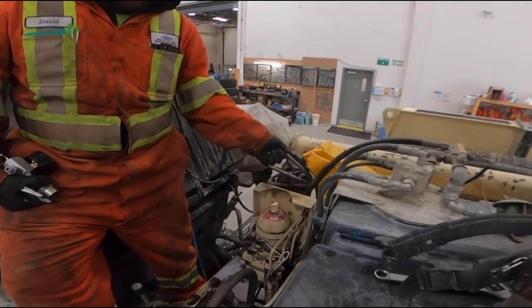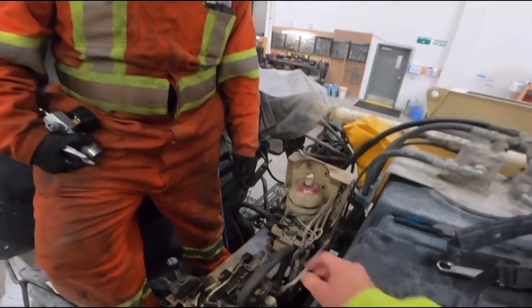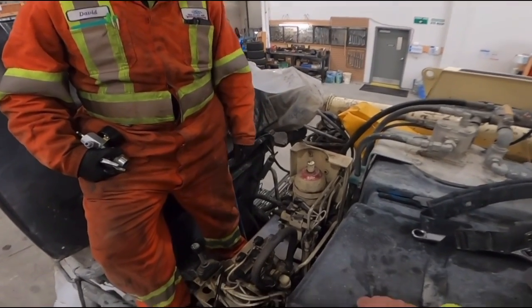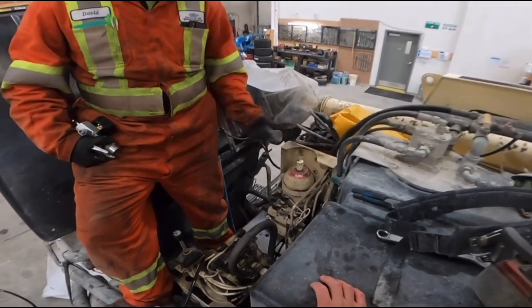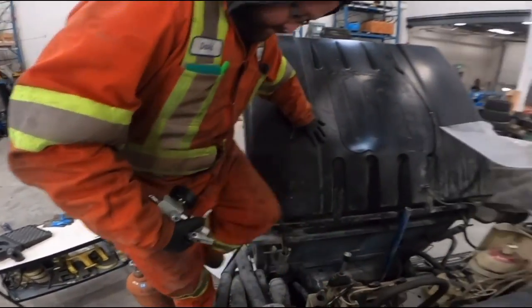A big three-way valve. And this is the line we put in to bypass the hard shift, soft shift, because those are prone to breaking and leaking, which is what happened to ours. So ours is permanently on hard shift. That flared pipe was always breaking, so we just threw this in. She's perma hard shift, which is just fine. You don't notice. They never get touched anyways. So that's all there is to it.